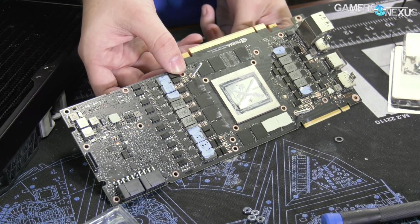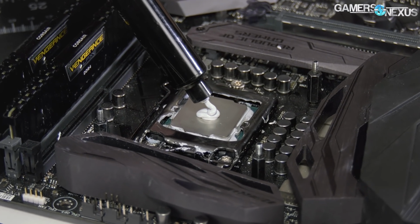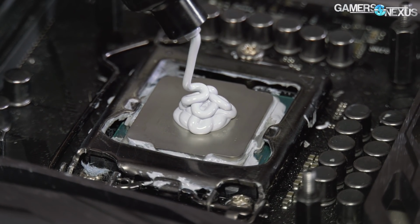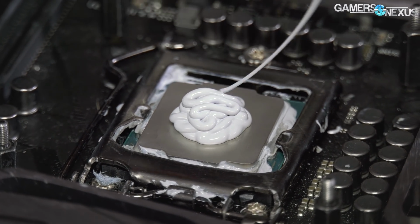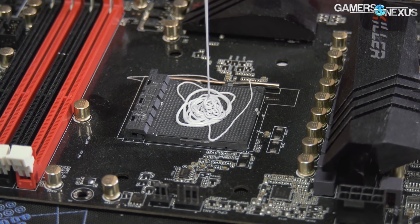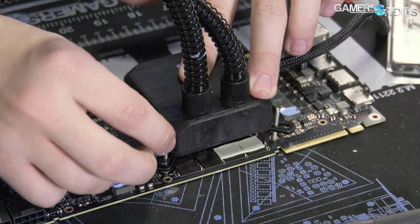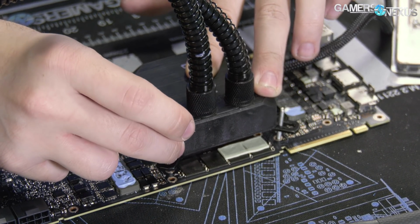So this is a sufficient amount of thermal paste. It will spread and cover the whole die. And we have a shot, I think, maybe we can drop it in, where I did the too much thermal paste with that Thermal Grizzly Cryonaut actually right onto an Intel CPU. And even when we did that in testing, there was no difference. The only difference is some of it gets into the socket, which kind of sucks when you remove the CPU. But otherwise, there's no downside in terms of thermals. So all we're doing is protecting potential lack of coverage, which would kill something. God damn it. It's the wrong fucking hole again. Now, the other reason for doing, quote, too much thermal paste on this is because I know it's going to be a slip and slide while I'm trying to apply the cooler.